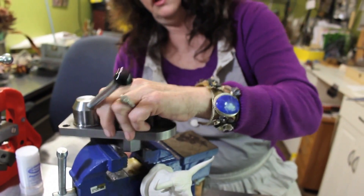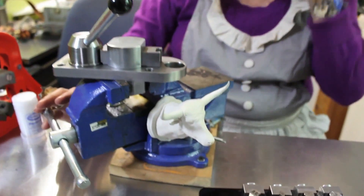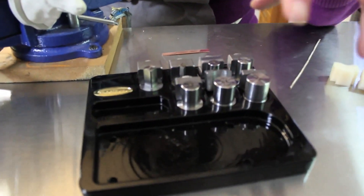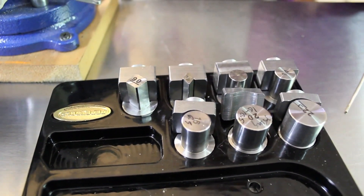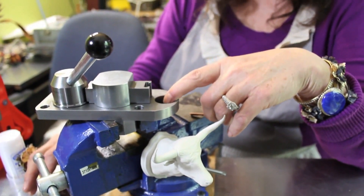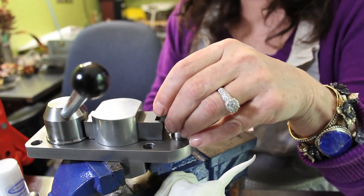You need some kind of Allen wrench. This is Fred, by the way. To use it for making a basic ring, the sizes are very limited. I found that number 20 is about a size 10, 10½, and number 16 is like a 6½. So you have to adjust the sizing. This is really awesome — it does its best work with really heavy stock where it's killing you to bend it over a ring mandrel. This is really thin but just for example. What I've found is you've got to put the round guy in first, because it's really hard to get the pushy guy in after.